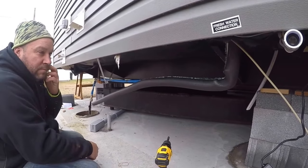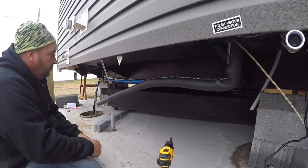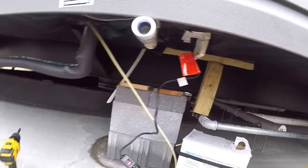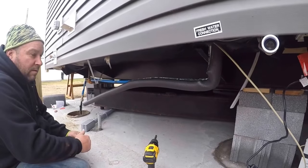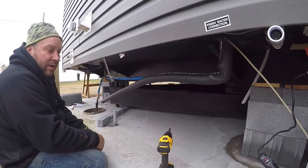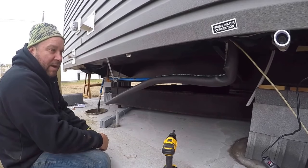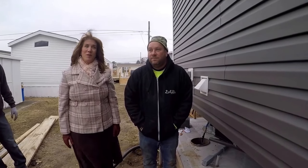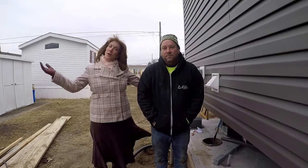It's a simple installation, easy to take care of, and something you should do around September or October. Get outside, check that the heat tape is plugged in and warm, and that your foam insulation is still intact. You should check it every year, and to be safe replace it about every five years. We'll be sending this video out to our residents because this winter we've had a lot of phone calls and issues, and it's important for them to understand what actually happens underneath their homes. We're sure other people on YouTube will find this informative and helpful. Join us here at Harbor Crossings.